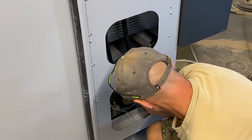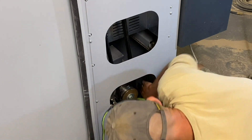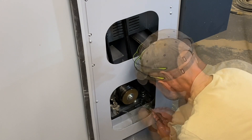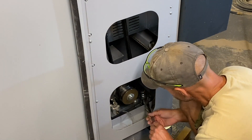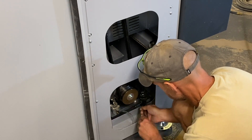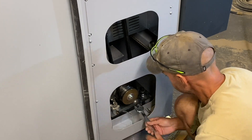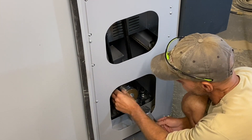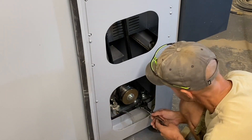What I found on mine is you can see the marks from the factory on the thread — I'll try and show you in a minute when I zoom in. The thing was set originally. It's a 24mm spanner. You don't want to overdo it but you don't want to underdo it either, because what you don't want is these spinning in the V-groove, which is what happened to mine and then they shred.